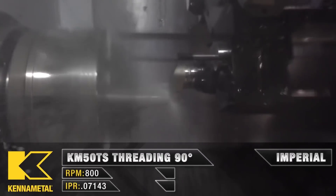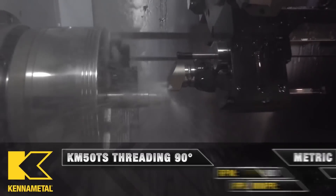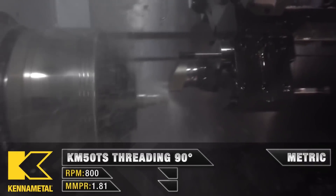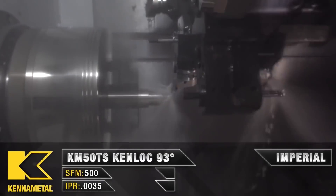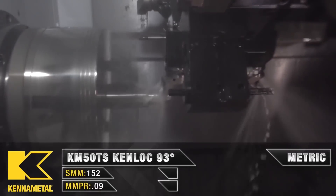Maybe not blazing fast — like 30 inches a minute, 50 inches a minute, mid-90s, just making parts. It's 10,000 RPM but don't run it over 7,000. The machine is very expensive. Let's just baby it, make amazing parts, move forward. Making parts every day, and every day I fell more in love.